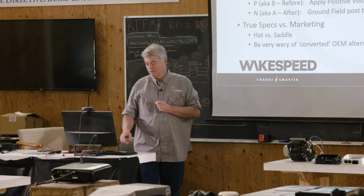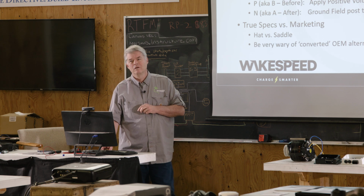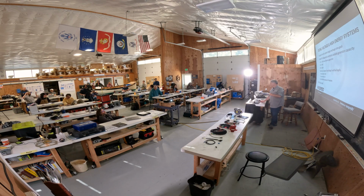Rick has actually one alternator that he likes. Which one is that, you say, is actually pretty good? Is it the Valeo? Yeah, the Valeo that comes standard on most of the Yanmars these days. It's actually very easy to modify. Balmar makes a kit where the regulator and brush holder are all one module. It pops out, you pop in a new one, it's three screws and you're ready to go. It's pretty cool, and it's a good robust alternator. Yeah, those 120, 125 amp Valeo alternators are good, particularly if you're in that 400 to 600 amp hour range.